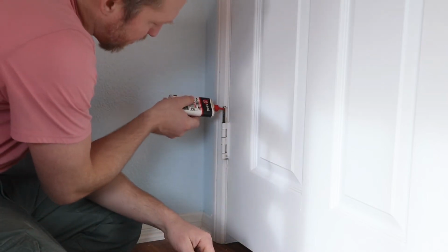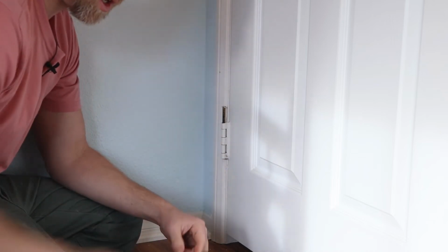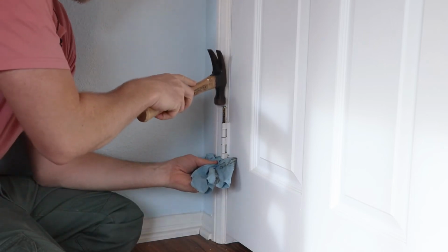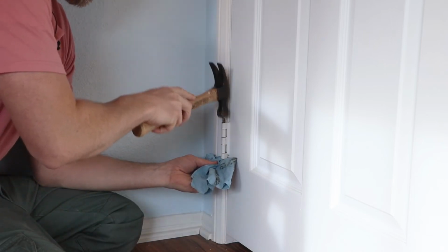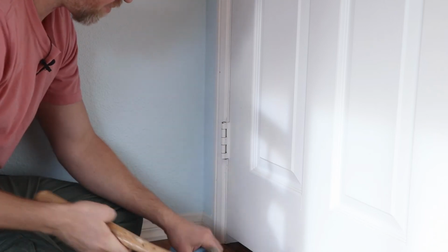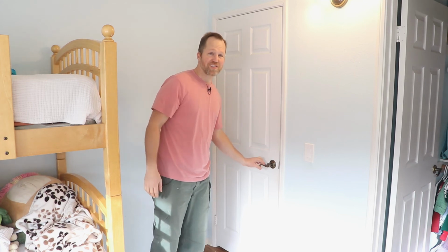And then just dab some 3-in-1 oil. Let it soak in. Use the rag to catch any excess. And then drive our pin back in. And if all has gone well, the squeak should be gone. Let's give it a listen.